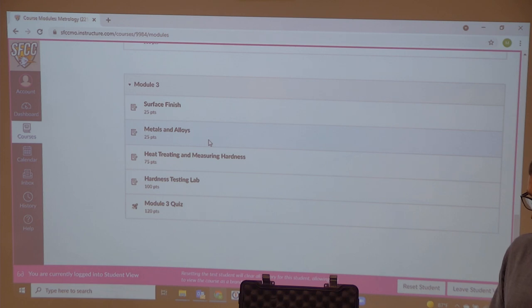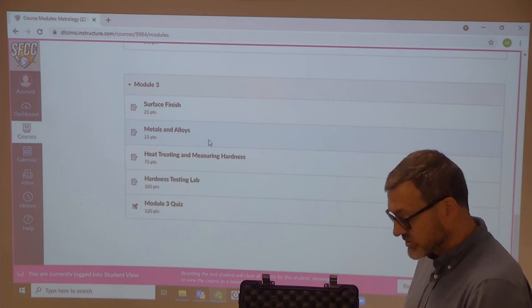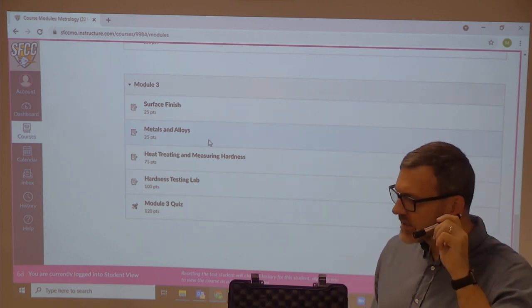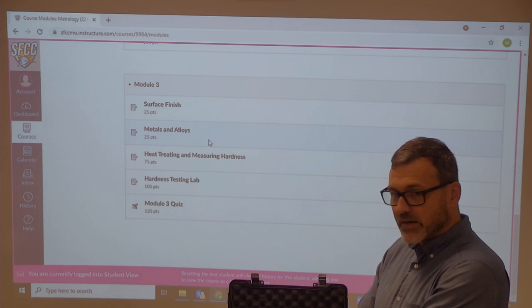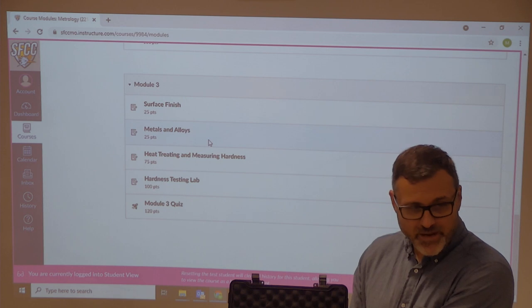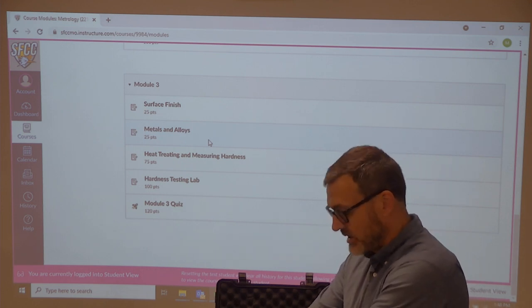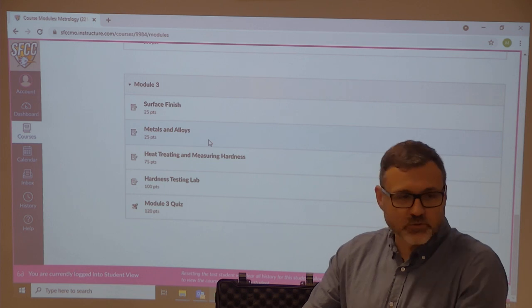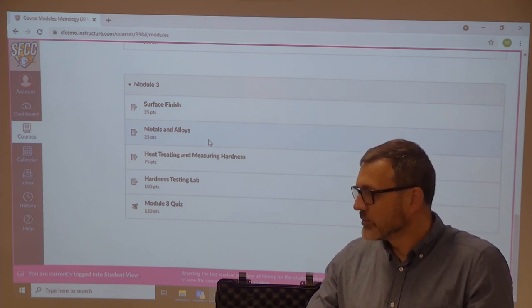The reason is that the way this hardness tester works is based upon a bounce. I've got a little marble, ball bearing kind of thing in here. I pick the bearing up, hold this down, and release the bearing. What it's doing is measuring the bounce that the bearing makes inside of there. When I get to something that's shallow or thin, like this, it doesn't work. The bounce is thrown off on it, you know? Like if you put something on there that's sprung, it would be able to tell this doesn't work.